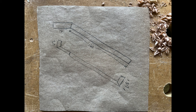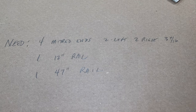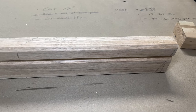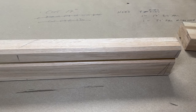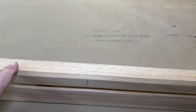Off camera I've drawn a little drawing of the railing so I know what it looks like, and of course I've made my measurements at the job site. I've written down notes on exactly what pieces I need. For example, I'm going to cut a 12-inch piece of railing — it's going to have an angle of 19.5 degrees at one end and a miter at the other end. Then I'm going to do a 47-inch piece of railing next.